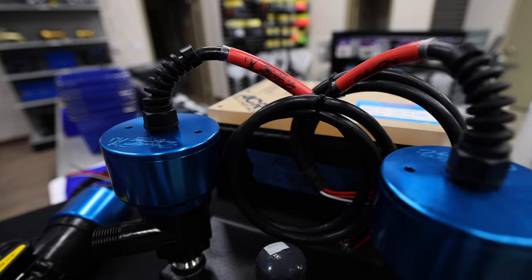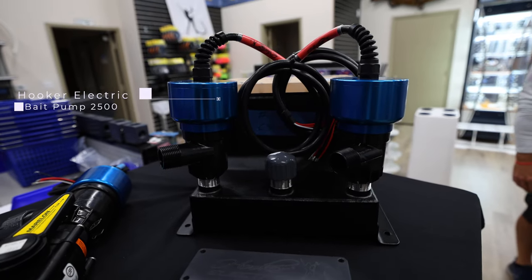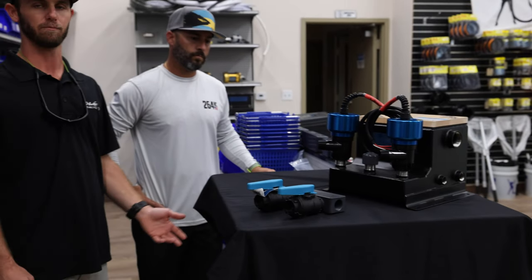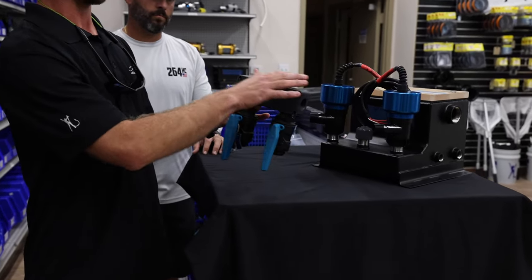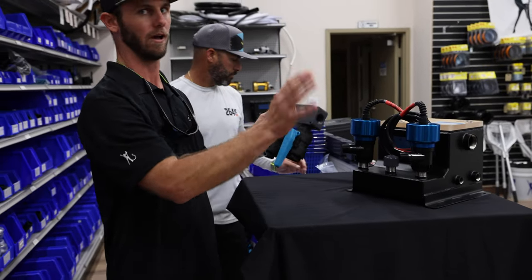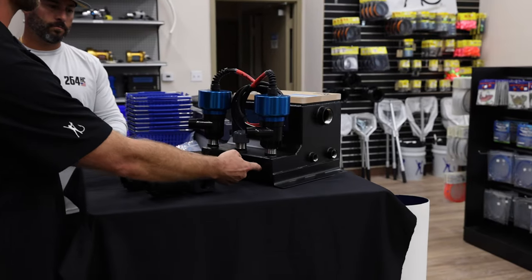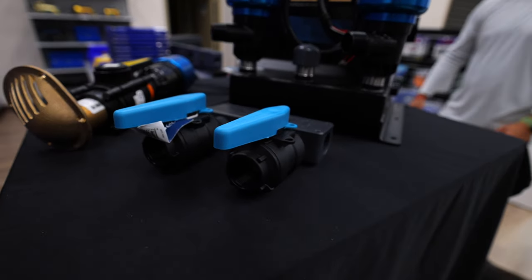We offer a lot of different style sea chests. This example shows two 2,500 pumps mounted onto the system, with a third bunk if you want to add a third pump — totally up to the customer. This is one of our custom manifolds showing two pumps going in, and then depending on your boat setup, you manage your ball valves to your systems — your secondary live well, third live well, however many systems you want, tuna tubes. On the side of the sea chest is the intake where water enters. The pumps pull from clean water at the bottom and go directly plumbed to your manifold system, which manages water going directly to all your live well systems.